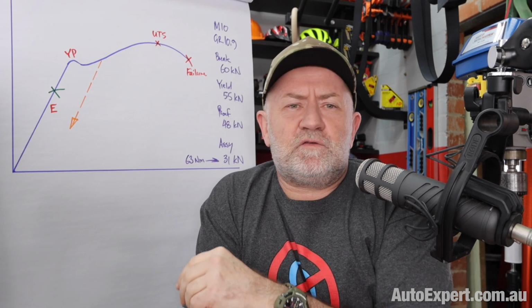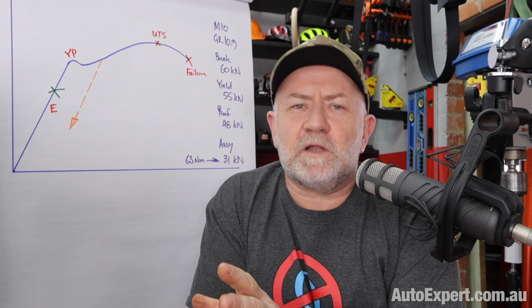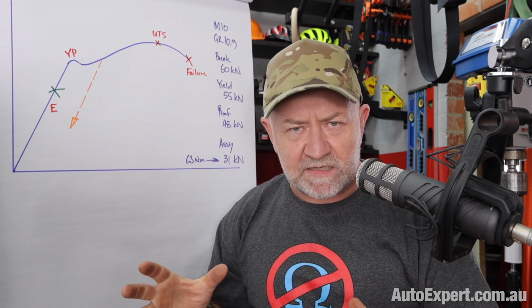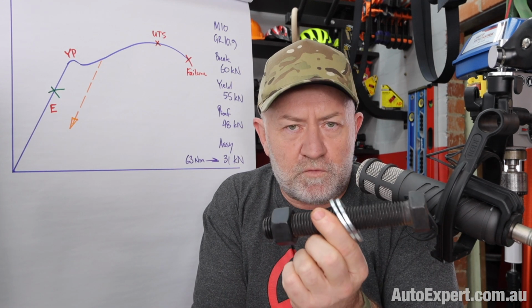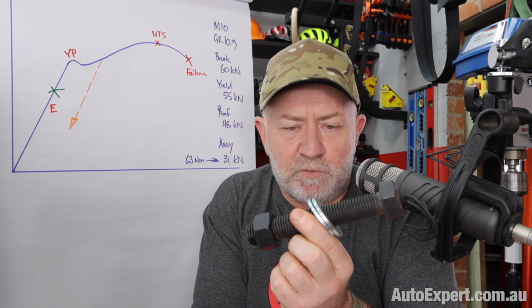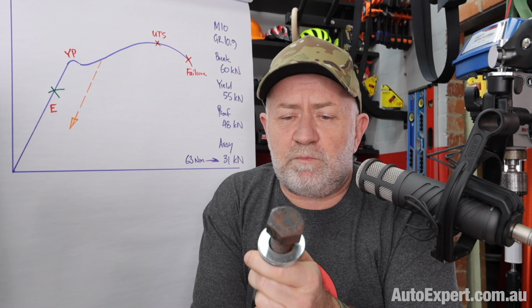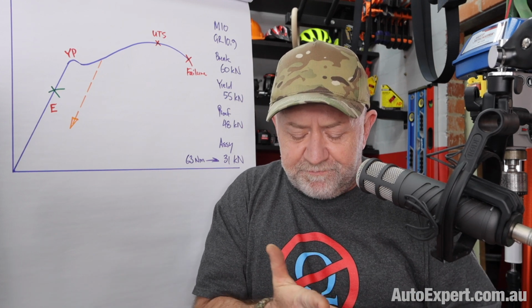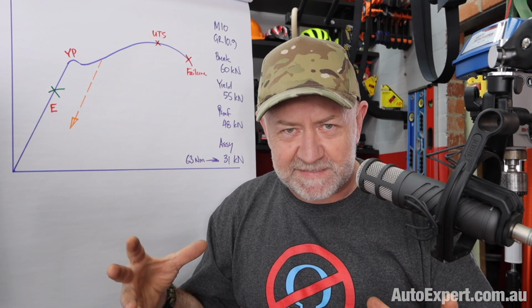The other thing you could do, and we're really talking NASA here, or Large Hadron Collider or things of that nature, scientific this and that, aerospace this and that. You can actually embed strain gauges. They actually grind and glue them onto the piece, and then they have to be calibrated, which is a pain and sort of a big job, and you need lots of specialised equipment to measure the elongation with a strain gauge. It's not very straightforward, but you can use a strain gauge to do it as well. So that would be the lexicon of ways to tighten bolts precisely, okay?